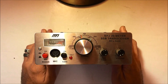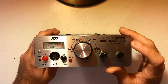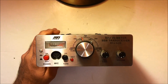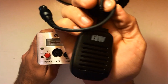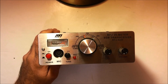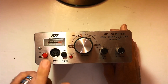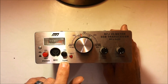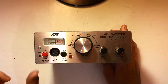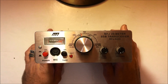We're going to go over a few things here. To start, this is the MFJ 9420X as they label it online, because it comes with the microphone — the 5-pin dynamic microphone, 600 ohm. This is the mic that's matched for it; I think it's $10 more to get it with the mic. So you have your power, your mic, your tune button. The tune button basically, when you engage it, sends just a load carrier so that you can tune your antenna tuner, then take it off and operate normally.